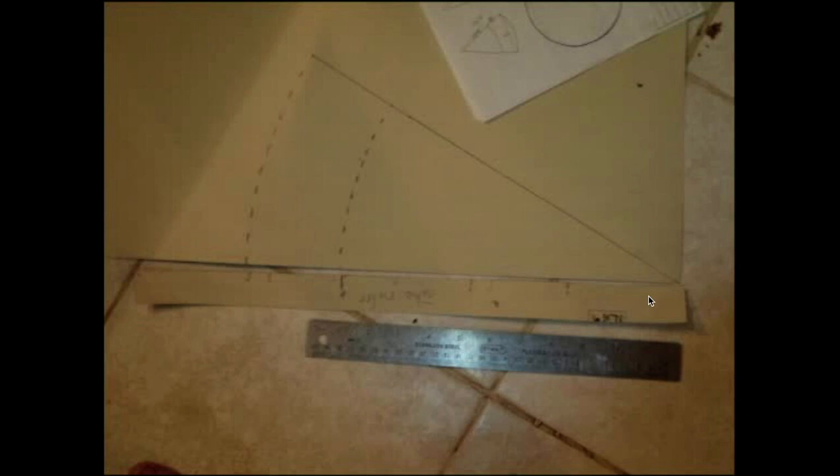Since my loop ruler was not long enough, I made a ruler out of the poster paper itself — the end of it. I made these two marks and then was able to get the curves each time, keeping the points here equal. Then if you cut that out, you're able to use that as a pattern to put on top of the sheet metal.